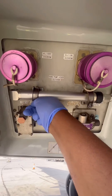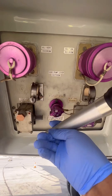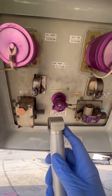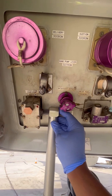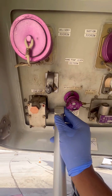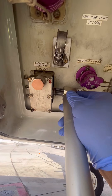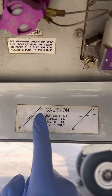For us today, we're looking for the hand pump lever and hand pump. The hand pump lever can also be used to service hydraulics — that's on the green hydraulic service area. Now we'll take out our hand pump lever and connect it onto the hand pump. It's a bit tricky the first time to align the splines on the pump and on the lever, but I'll show you a quick tip — don't worry, I've got you on this one.